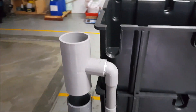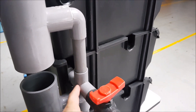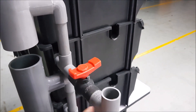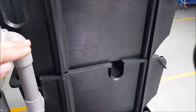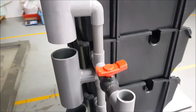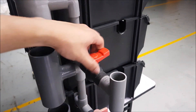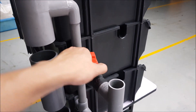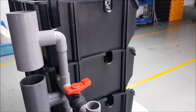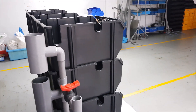The smile box avoids the need for outlet tubes to utilize space more efficiently. Instead, it uses what we call T-fittings — as you can see at the end of the box — that bend up to an outlet pipe. Having this bend-up causes the box to maintain a water level. You can also incorporate a flushing system onto a manifold like this, so when you open the valve it flushes out all the water along with the solids for a quicker cleaning process.